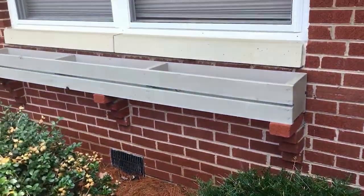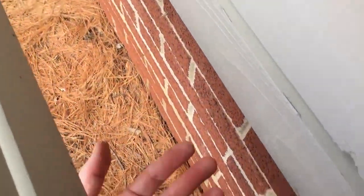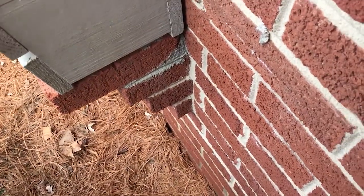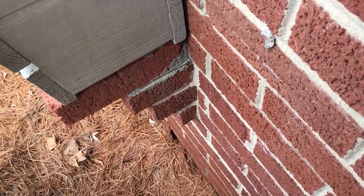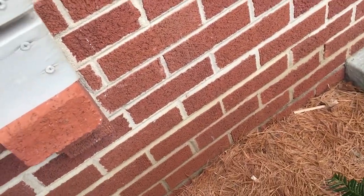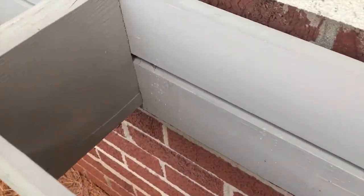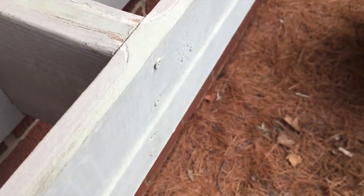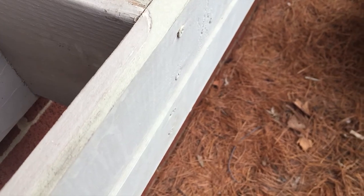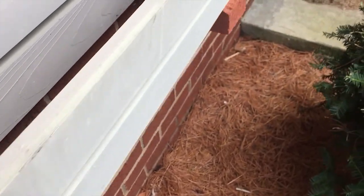Here's the window box out in front of the house. There's no bottom to it — you can stick your hand down through it. It's just some pressure treated wood, probably a two-by-eight or two-by-ten. I cut a little angle to give it some shape, put boards on the front, and used outdoor screws. This thing's been sitting out here a long time. It has some little dividers, and the width is made so the flower containers just catch on the edges and hold themselves up. When you water them, the water goes straight through to the bottom so it doesn't rot.